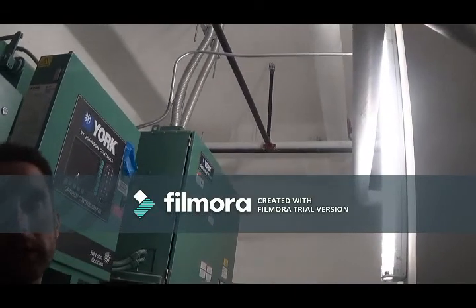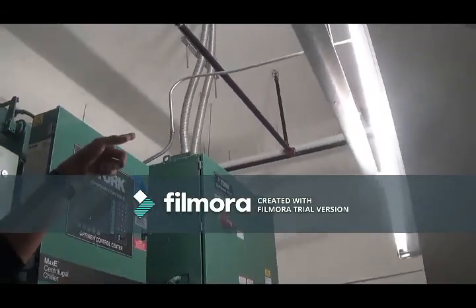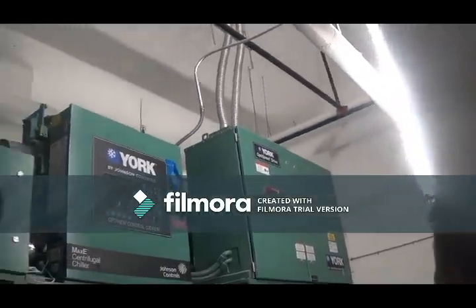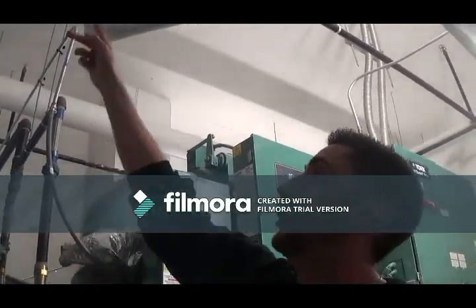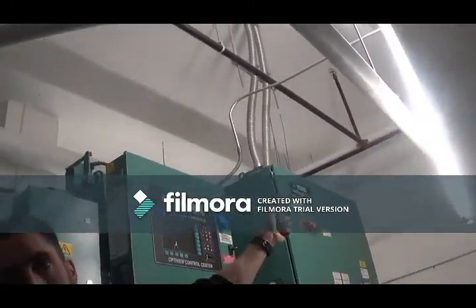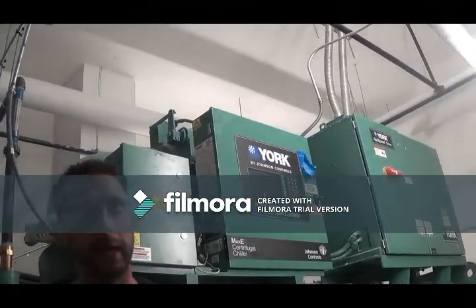Are we controlling that one? Yeah. So we can do a changeover for them? No, that's like a fan coil reset valve. Are we controlling the summer winter changeover though? No, those are manual valves. Oh, right. Yeah, so they have to come physically, unisolate, and open up. But that one is just going to be wide open for cooling season, and then in the winter we start modulating it to throttle back the boiler come through.